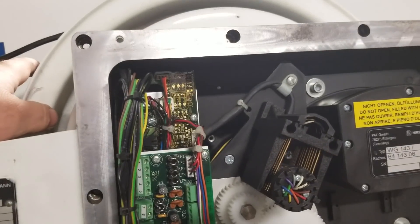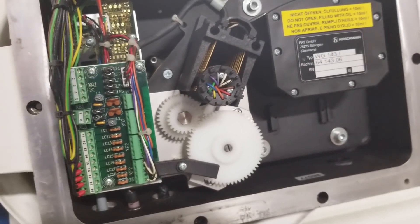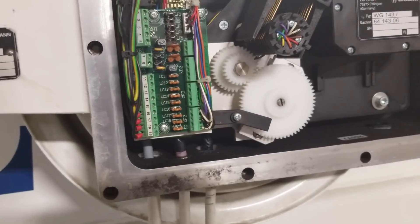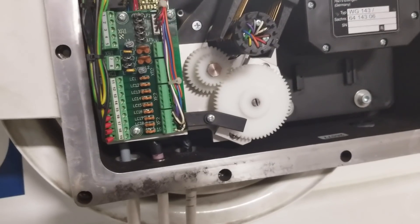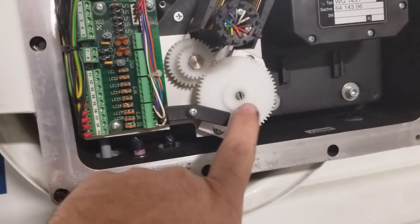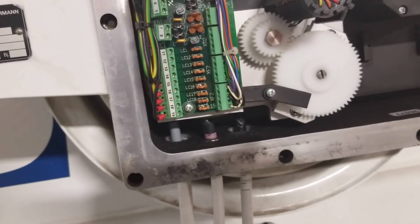After adding those wraps the drum will only rotate out two, three, or four more turns, so the boom length won't be reading correctly anymore — it'll think it's extended by whatever distance those extra turns represent. After tensioning we'll have to turn this adjustment screw back until the computer reads the correct boom length. On this crane, fully stowed, that's 35.76 feet. We'll start the crane up, see what it's showing, and adjust the screw until we get it reading correctly at zero boom extension.